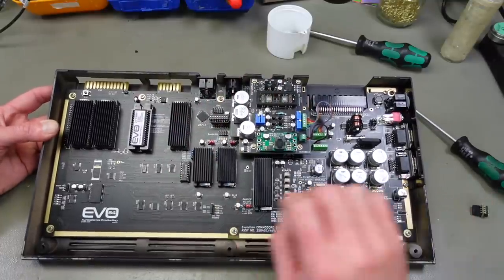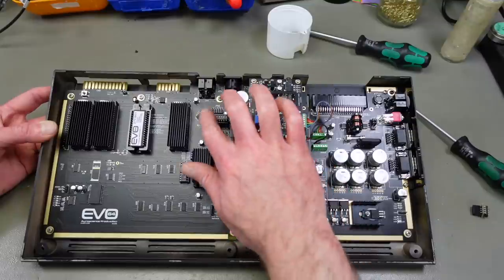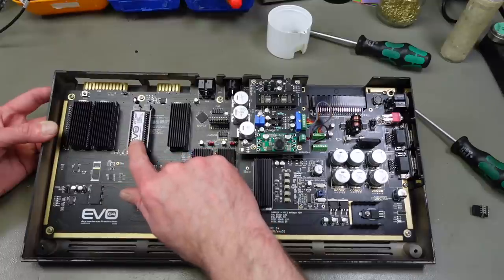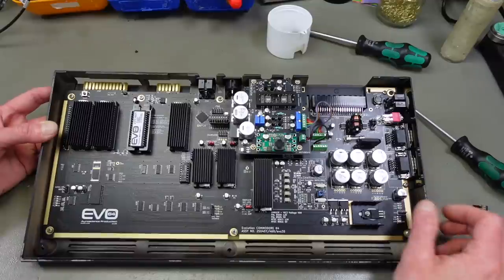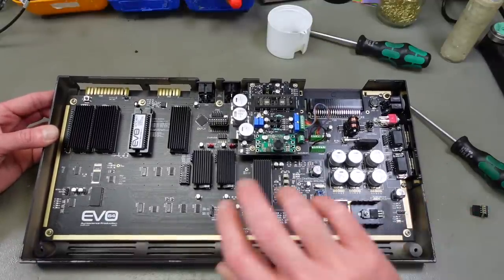And then we're going to have to burn an EPROM with the synth card in the appropriate position. And we don't even have to choose a memory bank on the multi-ROM that is in here to access that. Ideally, we just have to put this into cartridge mode, and if we disengage the cartridge mode, we should be in our regular BASIC. That's all I want.